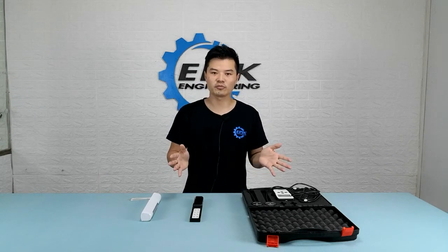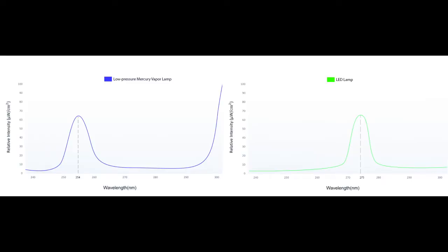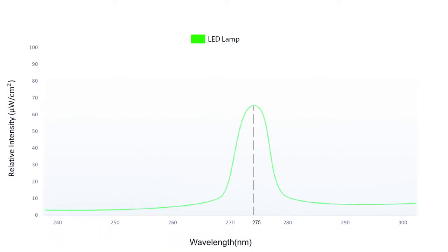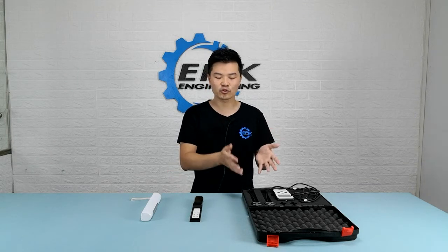The question is why two probes — why not just one? The reason is that these two types of lamps have the best germicidal rays, but they're not of the same wavelength. For the mercury lamp it's 254 nanometers; for the LED it's 275 nanometers. If you look at the spectrum distribution of these two lamps, you'll see that while the LED puts out a lot of 275 nanometers, it puts out very little 254 nanometers. So it wouldn't be fair to filter out the 275 and say the LED lamps are not as good as the mercury lamps. That's why we have two probes today.